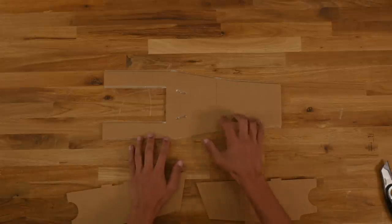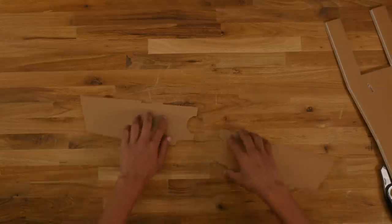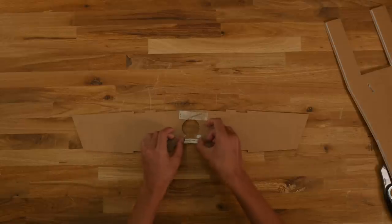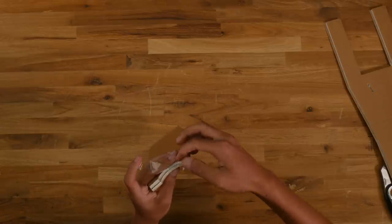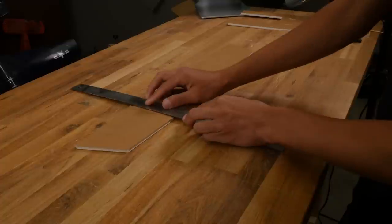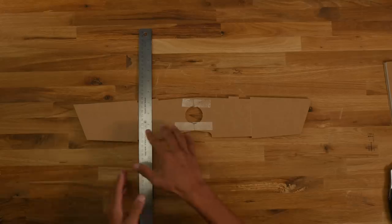Let's start with the bigger fork piece, which is the top of our fuselage, and we need these smaller side cheeks that go inside. Match these two up with the etched side facing up and tape them with a couple small pieces of tape in the middle. Try to avoid the hole because we'll need to stick wires through later. Flip it over, open the cavity, flip it 180 degrees, and put tape on the other side to seal it well. Next, take a straight edge and lay it against the etch mark, then bend the foam up about 30 degrees to tell the foam where to bend.